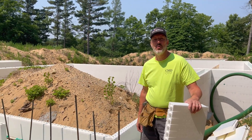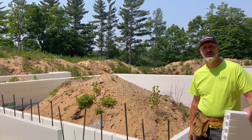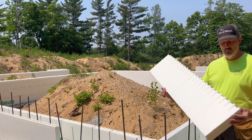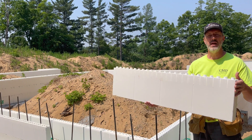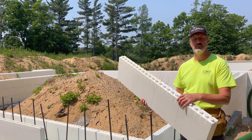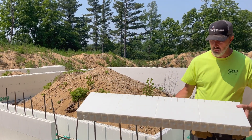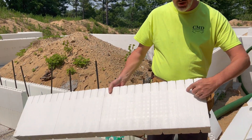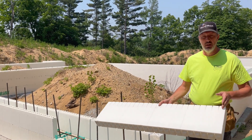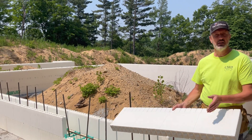We're almost done stacking up our Quad Locks, but I wanted to take a quick moment to show you how this system works in case you're thinking you might want to try it. The general Quad Lock building block is a four-foot by one-foot panel that is styrofoam and comes in different thicknesses — this one is three and a quarter inches thick. It has two-inch intervals so you can build anything in a two-inch increment. If you have a 36 by 24 building, it's easily a two-inch interval, and you can adjust with a simple Sawzall to cut it down to the size you need.